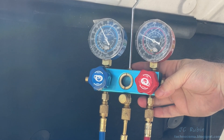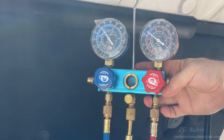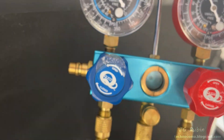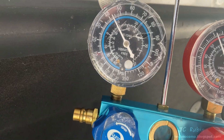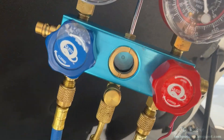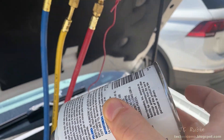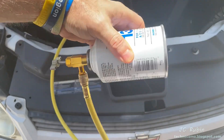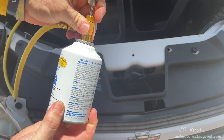It's on the second can that I'm going to be metering the amount of refrigerant going in. At this point my camera is about to cut out due to the heat, so I'll show you what happens when this can empties. When nothing more was visible in the inspection hole and the can felt empty, I closed the low side valve. However, I did hold the can entirely upside down, shake it, agitate it, and check the inspection window because it would start flowing again. Making sure I got all the contents of the can before closing, and then once fully empty I unscrewed the can and removed it.